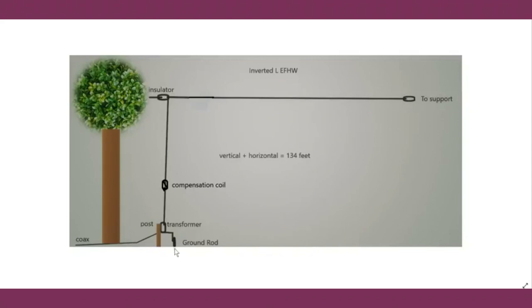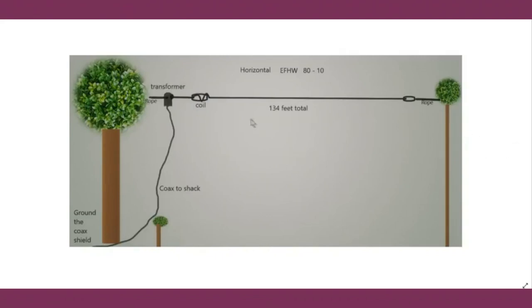Ground the transformer with a ground rod. The transformer can be placed close to the ground — maybe a foot or so off — and the coax runs to the shack. The horizontal version of the 80-through-10 meter antenna is 134 feet long. My installation is at 80 feet high, fed with coax grounded at the shack, running about 20 feet across the ground. It's a tremendous antenna — covers all bands with low SWR everywhere. Only 17 meters gets up to about 2:1; everything else is really nice and low.